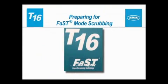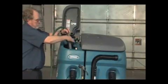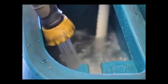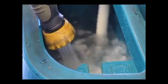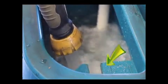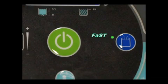Optional FAST mode. FAST scrubbing technology offers the advantages of using less water and detergent than conventional scrubbing. Unlike conventional scrubbing, the optional foam scrubbing technology, or FAST mode, operates by injecting the FAST pack detergent concentrate into the system with a small amount of water and air. To use this technology, fill the solution tank with clean, cool water only. The water temperature should not exceed 21 degrees centigrade or 70 degrees Fahrenheit. Do not use hot water or add any conventional floor cleaning detergents, or a FAST system failure may result. Fill the solution tank with water until the level is just below the indicator tab. Do not use flammable materials in the tanks. Next, turn on the key switch. Then press the FAST switch to enable the technology. Next, press the large green one-step scrub button and start scrubbing.